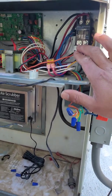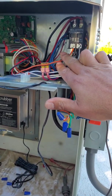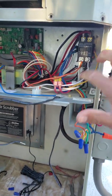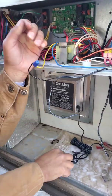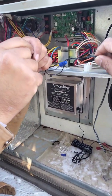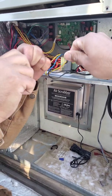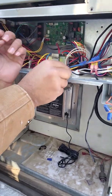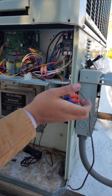The transformer is now installed and wired to the contactor — orange is on one line, white is on the other line. Now he's going to wire in the low voltage side. On the air scrubber, it does not matter which side whether it's 24-volt or common — you can go to either side. That's it — now he's going to power it up and show you that it's working.